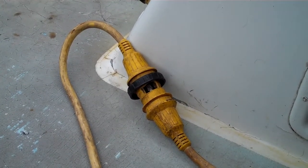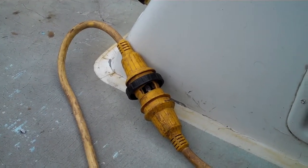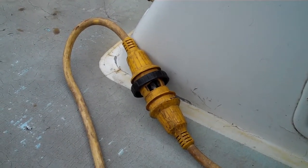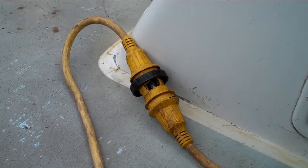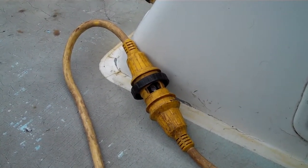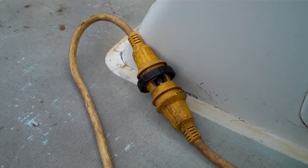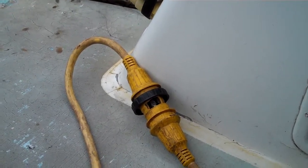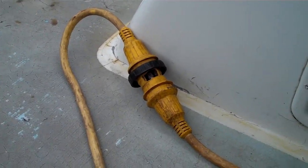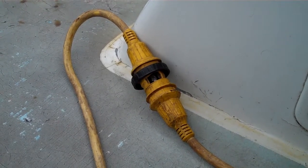What I normally do is leave my hot water heater off and turn it on in the morning while it's still cool out, before I'm running both air conditioners. That way I'm only pulling about 12 amps with the air conditioner and another 10 with the hot water heater. Once the hot water heater is done, I take my shower and everything's good.